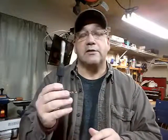Let's go ahead and get into the process so that we can show you how fun this can be on a drill press. A few accessories that you're going to have whenever you start your process: a drill press, a 5/16 drill bit. You'll have to have a tap. I think it's a 3/8 tap. Got that at Lowe's. And then you'll have to have a threaded rod.